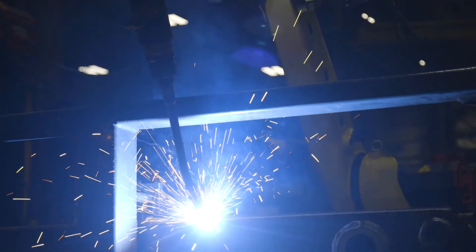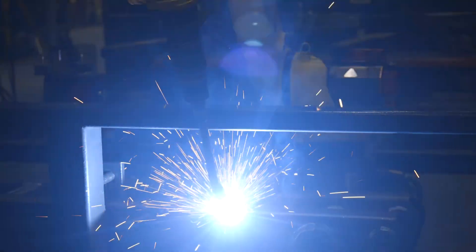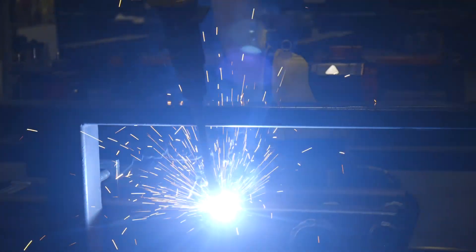This constant increase in heat can affect the quality of your welds over a period of time, as well as lead to premature wear of the torch's front-end consumables, mainly the contact tips. Something that will surely affect the decision you make is the investment of an air-cooled system versus a water-cooled system. With water-cooled systems, there will be more upfront costs and a little more maintenance involved. You'll need to monitor the system for leaks and change out o-rings in the coolant when necessary. However, due to the extended lifespan of consumables from internal cooling, running the cell itself will be much cheaper over time.